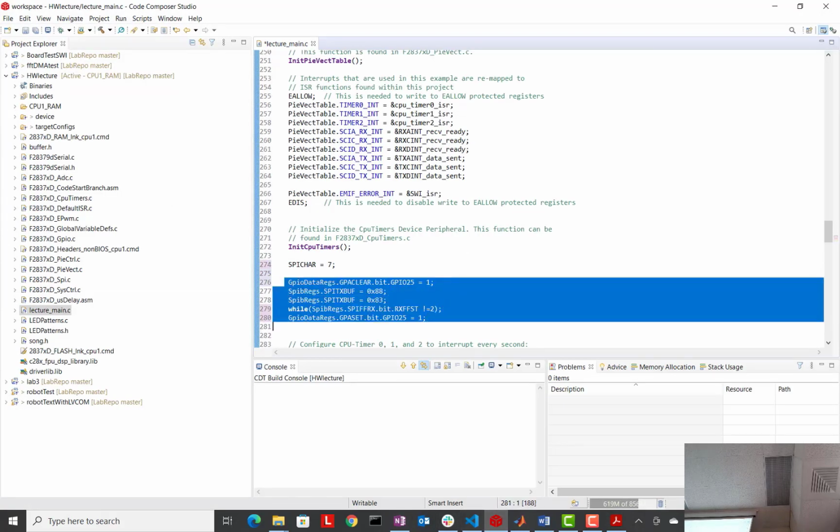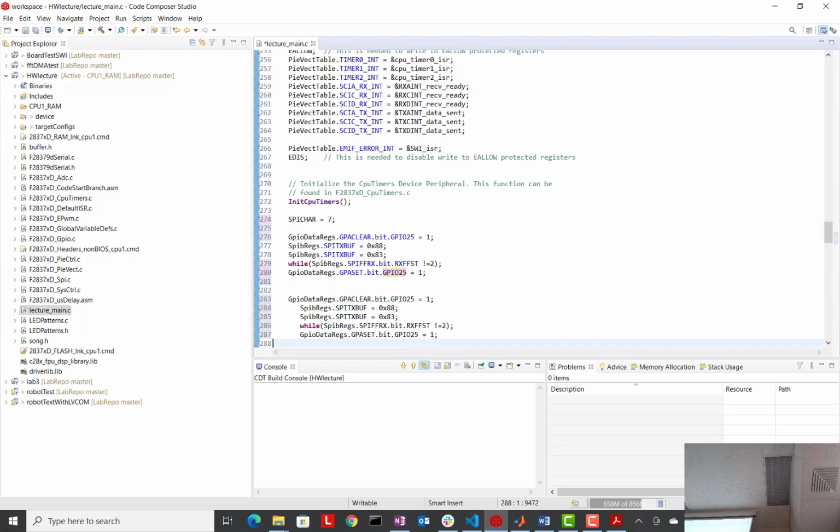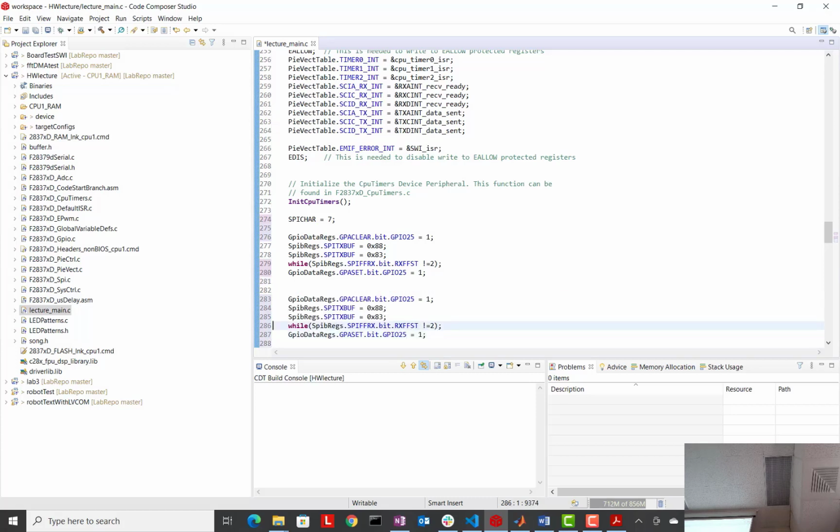But what we are going to find that we've got to do in our code, the next thing we're going to do is Control C, Control V, MDR1 we need to set up, right? The first one was MDR0, the next one is MDR1. We won't go through this, just trust me, what you need to send over is hex 90 and then 00 is what you want to set up MDR1 to, okay?